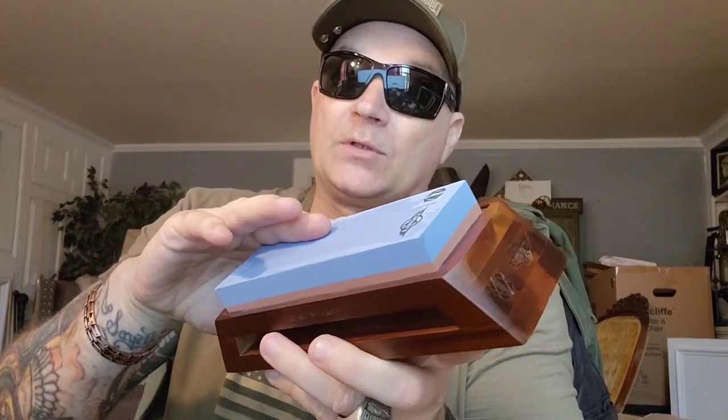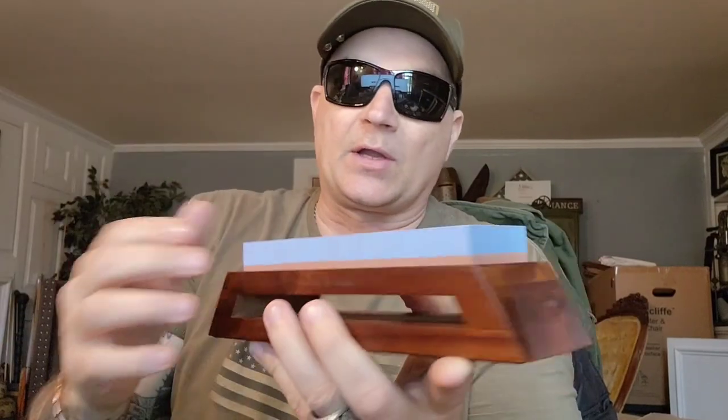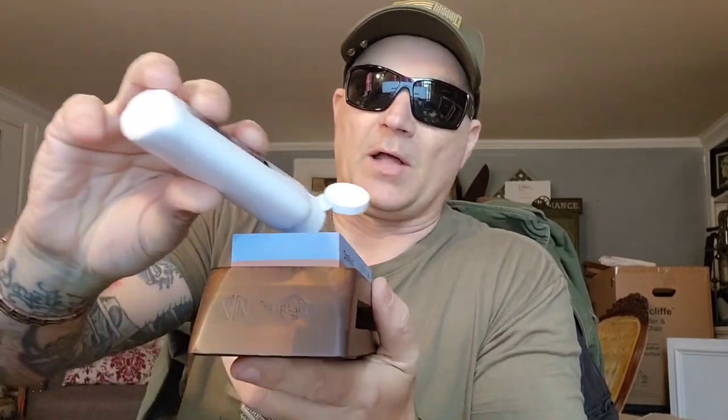I'm going to put some oil onto my stone and then smooth the oil. You can use water, honing oil — which I'm using — linseed oil, or all kinds of different things. With this stone I'm noticing it's absorbing fast. There are two kinds of stones: a splash-and-go where you just keep splashing liquid on and go, and the kind you soak. I bet this one I could soak and it would just sit right in. I'm going to put enough oil on there to have oil on top — it looks like it's absorbing really nicely.